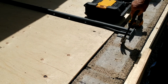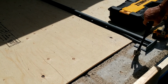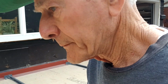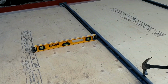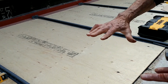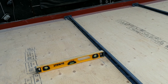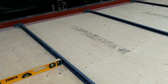Are you putting wire mesh on? Yeah, 6x6 wire mesh. I don't think the drawing calls for it, but I don't think we should do anything, just concrete. Well, the thing is, my issue is that you have rebar here, rebar there, but in the middle there's nothing to tie them together. Rather than wire mesh, we should just lay rebar on top of it. It takes up too much space. You can't put rebar in 4 inches of concrete. Too much space. Wire mesh.